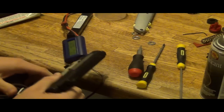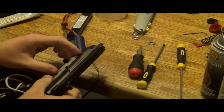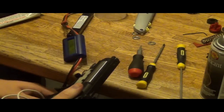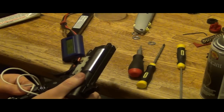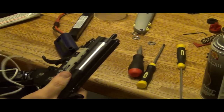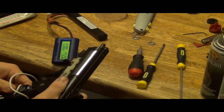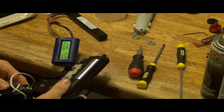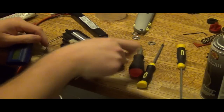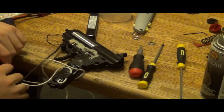This is beautiful. Okay, we're going to leave it like that for now. So I'm getting under 20 amps. The motor is barely warm after that. The wiring, there is nothing warm. This is going to be very efficient because it is well shimmed. It's got some nice thick wiring. This is ready to almost go pretty much. I need to take this out and shoot though to show how badass it is right now. So we're going to go ahead and disconnect everything.